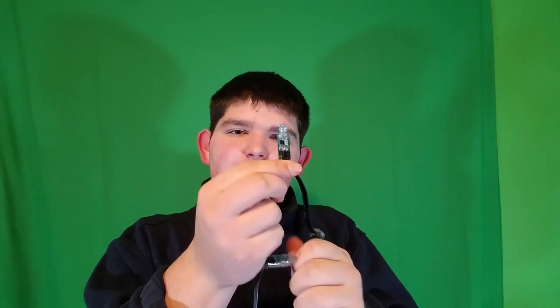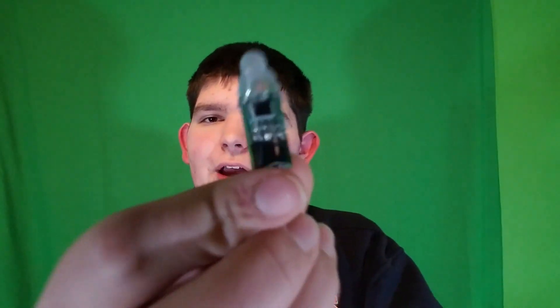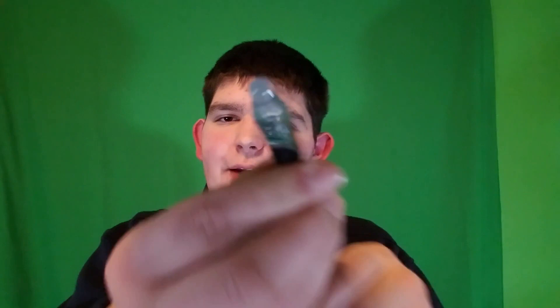These lights can be programmed to do a bunch of different patterns, and the limit is your imagination. You can have this light flashing red, while this light is fading yellow, and this one is flashing between green and blue, and the rest all on white. You can have them doing anything you want at any time, which makes them really cool. The way they do that is the lights need data, and each individual pixel has its own microchip inside of it. So you send power and data to the lights — the power powers the lights, and the data tells the chip inside what color to turn on and how long to do it for.